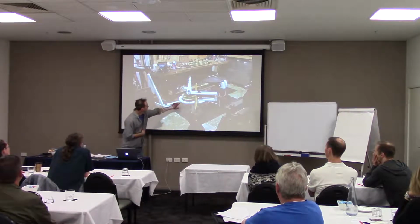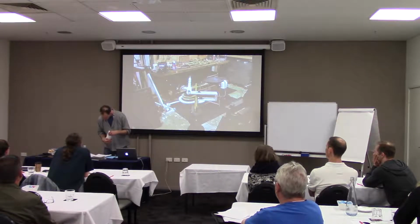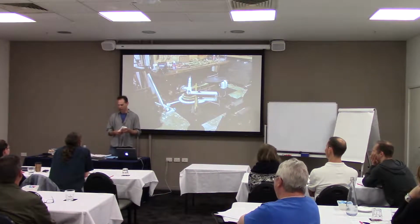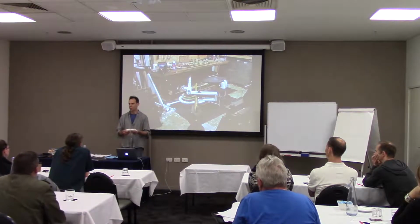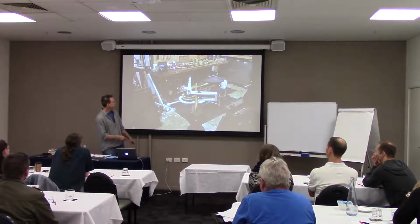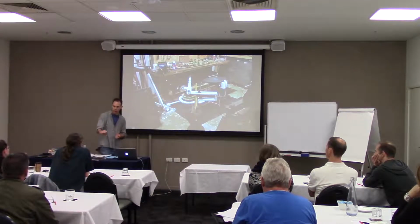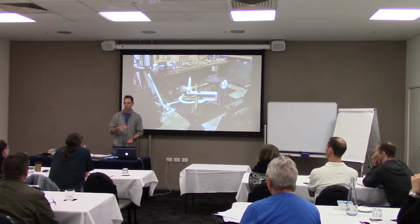But this stuff here, that's jet set, or I think they call it morph. There's another name for it here. Oh shoot, something morph. I was carrying this through the airport, and it looks like little pellets, and I'm sure you've seen it in other things. Some of you use it, but it's awesome. You just melt it in boiling water, and then you can put it around whatever. If you've got a taper and it's straight, just run it around, and it'll take that form, and then let it cool, and then you can bend on it, and it will support the wall as you come around.